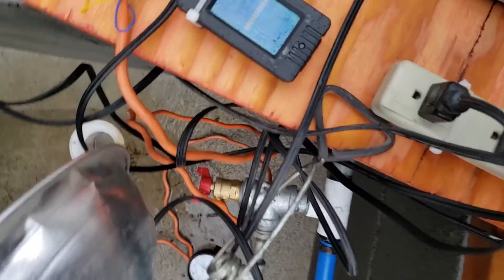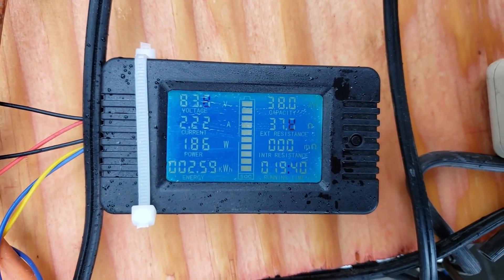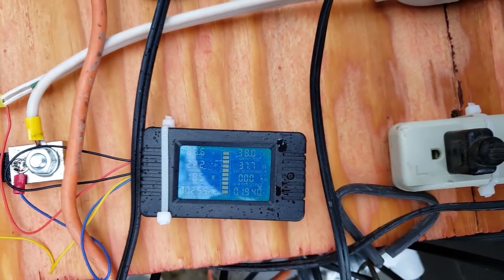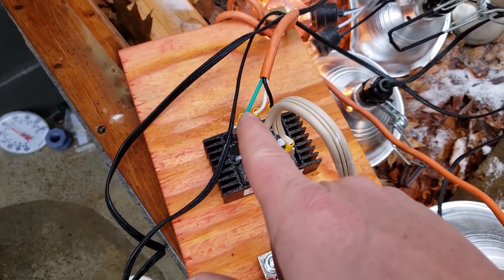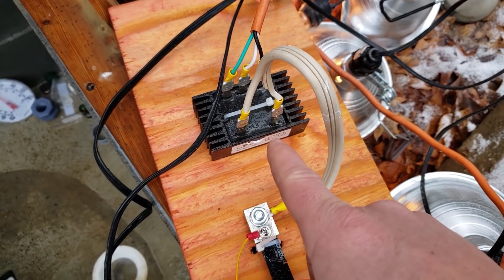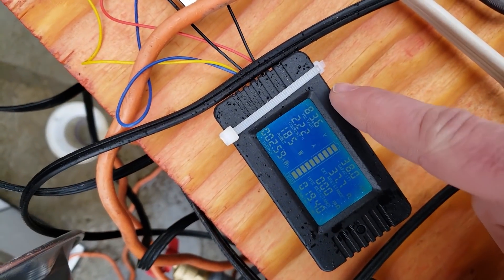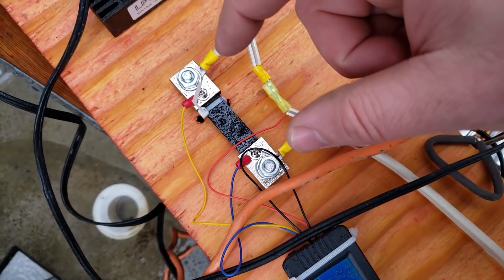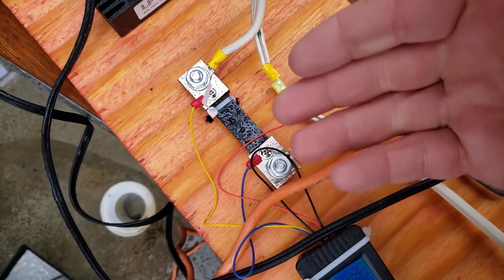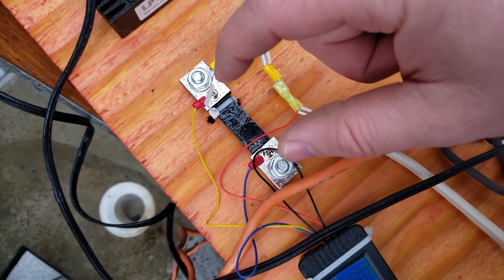Let me wipe this off to see how many watts we're getting — 185 watts at 83 volts DC. The alternator is generating three-phase AC, which comes into a rectifier that converts it to DC positive and negative, just like in a car, but at much higher voltages — 83 volts DC. This is a shunt amp meter that's been finely calibrated. If you measure the voltage difference between the two sides, you can do the math and get your current.